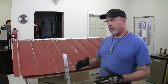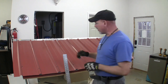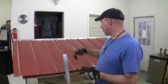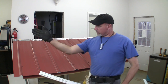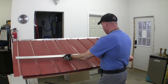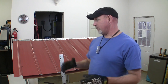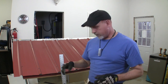So when you get that other panel up, a way that I found that works pretty good is to get that panel up, get it lined up the way you want it, and go ahead up here at this top purlin and run a couple of screws to hold it in place, and then come on in here and start putting your screws in. There again, remember I could see the purlins running down through there. I knew where my screw holes were here, so I could take that framing square, this drywall square, and lay it up, come through, and mark where my holes were going to be. Like I said, you could pre-drill these if you wanted to, but that's proceed at your own peril, I suppose. So this way worked out pretty good for me.